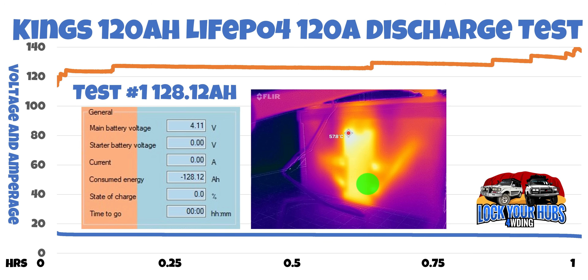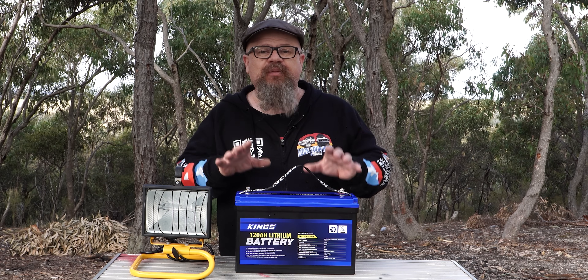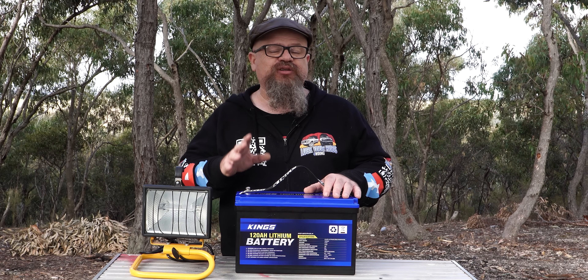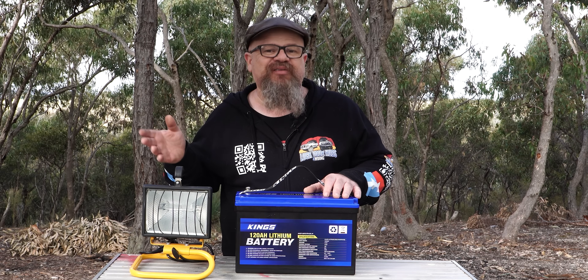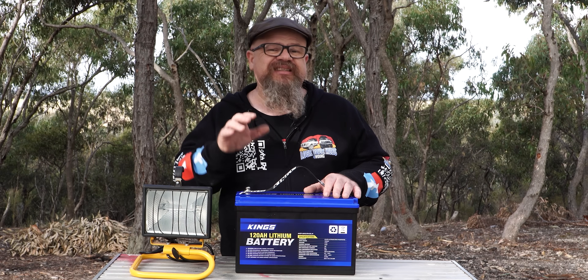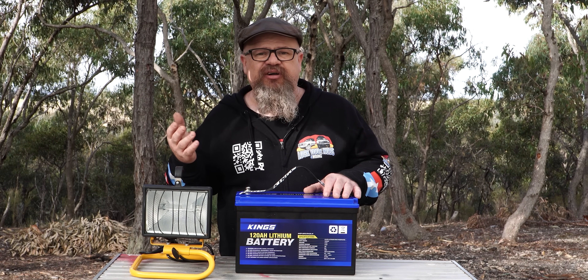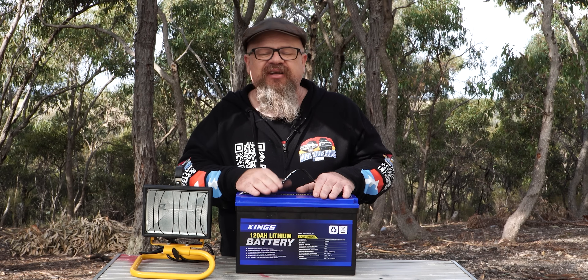So when we do the disassembly, we'll see if we've melted anything. Our 128.12 amp hour capacity is still nearly 7% over the 120 amp hour rated capacity. Absolutely fantastic — I'm pretty impressed. It turns out the label on the front isn't lying. It will happily maintain its maximum rated current of 120 amps from completely full to completely empty. By the end of the test it was about 130 amps being drawn, and it did get a bit warm. Once the test was completed it wouldn't accept a charge, but after 10 minutes of cooling down time it started to accept a charge. As far as performance is concerned, it passed those tests.